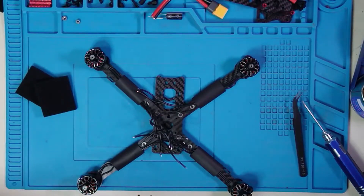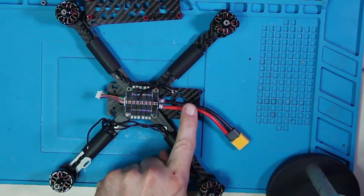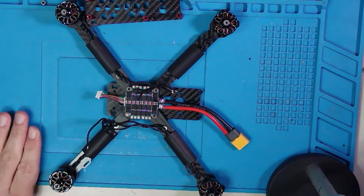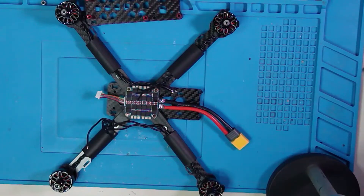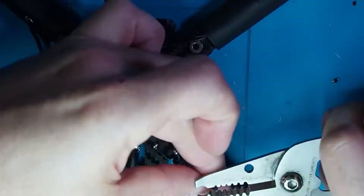With the motors on, we are getting scarily close to the part I hate the most, which is the soldering. I am painfully aware of how bad my soldering skills are, and that is actually why I do the power leads first, because the wires are the thickest gauge and to me that is the hardest part to solder. So at this point I'm going to go ahead and pre-tin all of the pads and start soldering the 12 pads for all four motors.